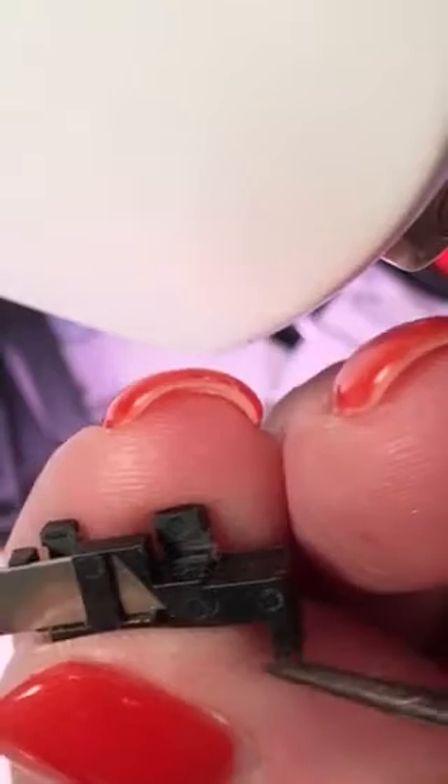All you have to do is take a pair of needle nose pliers and pop off this blade right here. Make sure it's a new blade. If you've used your blade before in this cutter, take that old blade off and then just pop on this new blade and put it in this slot. You want the blade to be pointing up and away from this arm. The blade goes out on top and fits right into this little angle piece right here, so you can just replace that blade without having to buy a new one.